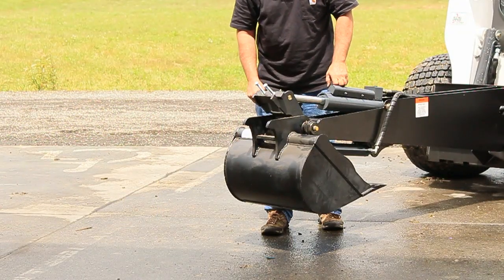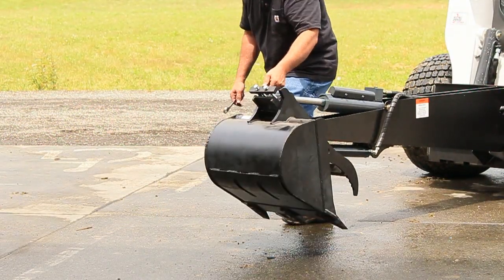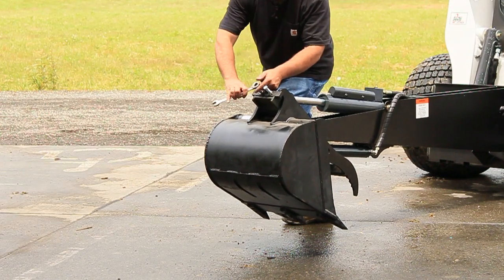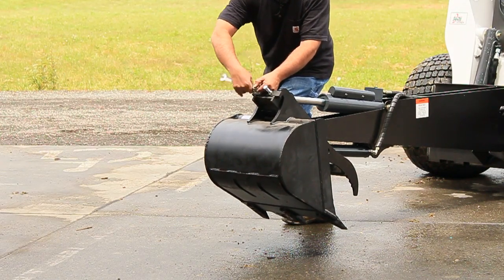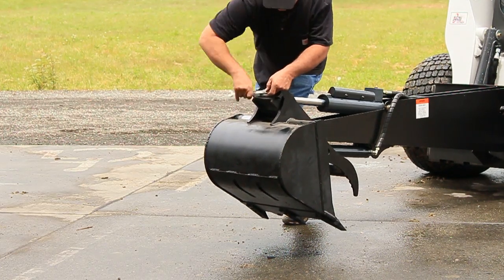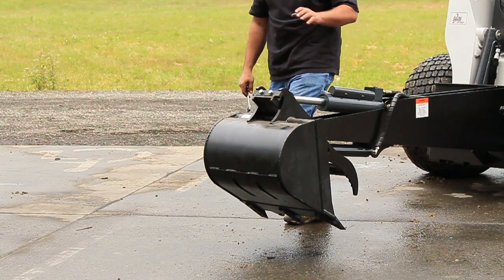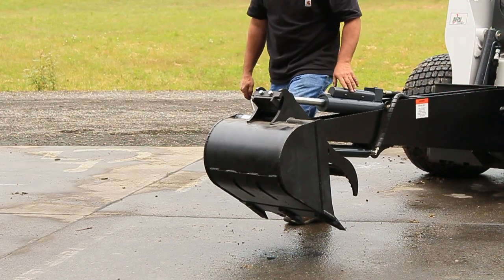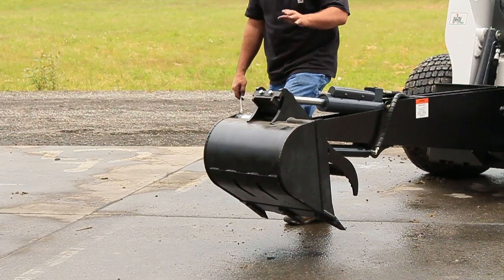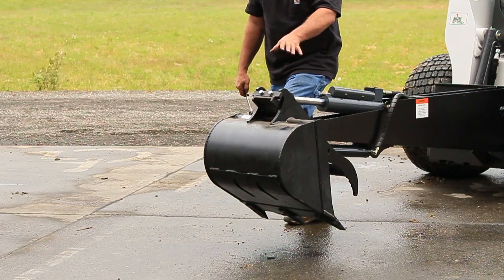I've dropped the bucket over the lower ears. All I'm going to do is hold my wedge block up, push the bucket down, let the wedge fall into place, and I'm just going to tighten up my bolts now. After each use, you always want to double check and make sure that the bolts are tight, because when the buckets are new you've got a little bit of powder coat paint on there — it could make it sink down and loosen up on you.